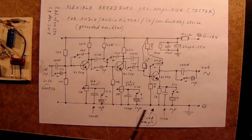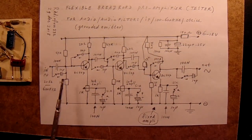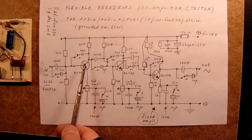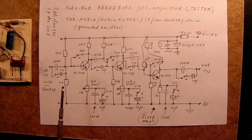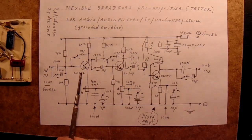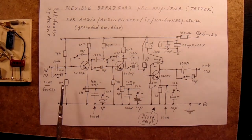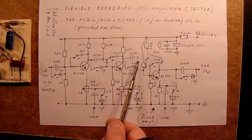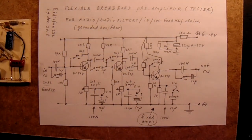As we know from the radio theory and the transistor technology, for a high frequency transistor the engineers do all that's possible to prevent internal capacitance. The internal capacitance in a high frequency transistor is extremely low, say 1 picofarad or 5 picofarad. And for the VHF transistors perhaps it's even smaller, 0.5 picofarad. I don't know that exactly, but you can study and find much more info, I'm sure, on the internet. So switching them on or off: on for audio circuits, open, switch these 100 picofarad capacitors off for the typical high frequencies, say 100 kilohertz up to 500 kilohertz, perhaps 1 megahertz.